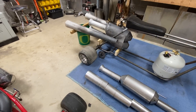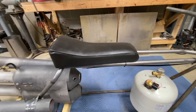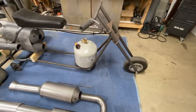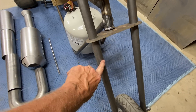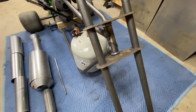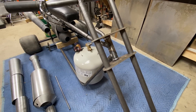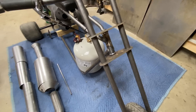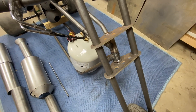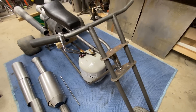This is a super cheap build for me because I had almost everything — I hardly had to buy a thing. I bought a like a $25 actual mini bike seat so it would look like a real mini bike. The inch-and-a-quarter tubing here was just a neck out of a regular old bicycle somebody gave me — a wreck bike — and I just cut that out. Then I had these parts here water jet cut out of quarter-inch regular mild steel.